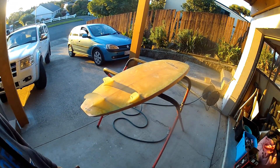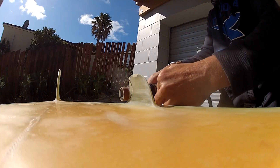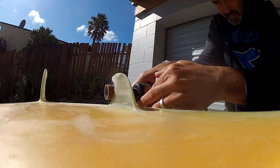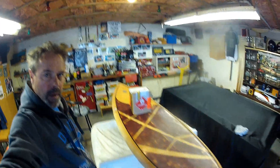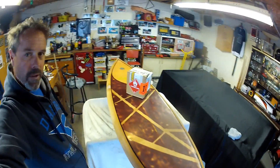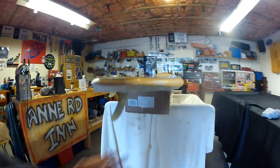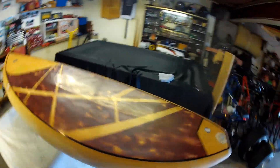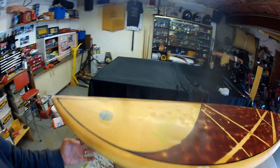After that we should be good to go for clear coating or gloss coating. Our resin has now arrived from the courier — seven days to travel 90 kilometers in lockdown. We're now going to prepare our top coat. I've run a tape line around the edge to catch any resin that runs over, and wiped down the deck with acetone to ensure it's nice and clean.